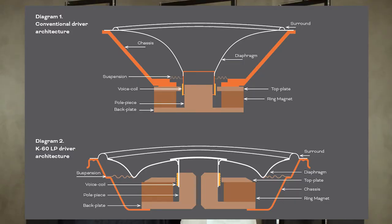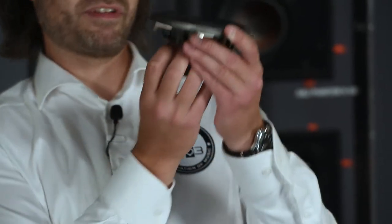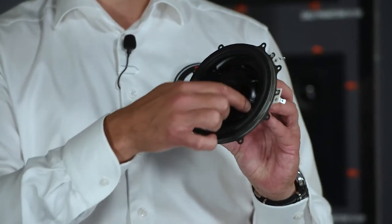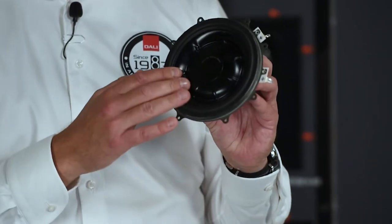The cone is inverted to allow the magnet system and voice coil to be placed within the cone, as opposed to below the cone as you typically see on other bass driver designs. By attaching the spider to the membrane instead of to the voice coil former or the bottom of the unit, we can greatly reduce the depth of the driver without sacrificing excursion or low-end response. The aluminum membrane of the bass mid-range driver is embossed with a structure on the edge of the cone which stiffens the membrane without adding any weight — you may be able to see those structures here. The structure is based on an uneven number of points to ensure no unwanted energy is built up due to cone modes.